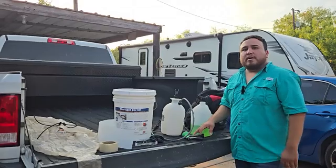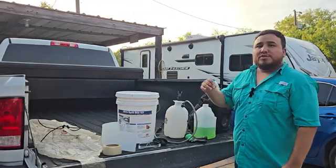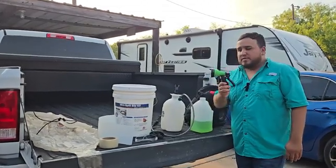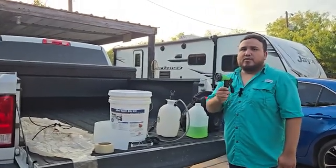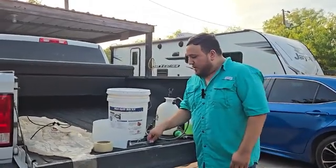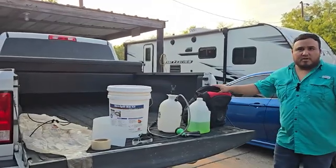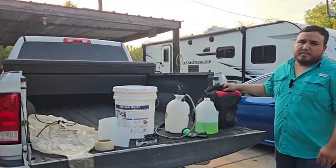The other thing I'm going to use is an ordinary garden hose. I know some individuals use a coil jet sprayer, but I don't have one, so I'm going to use an ordinary garden hose and a nozzle. This nozzle will provide some pressure to push out any gunk or debris from that indoor coil and the blower wheel itself. Safety is always a priority — make sure you're wearing the proper PPE, like safety glasses and gloves.